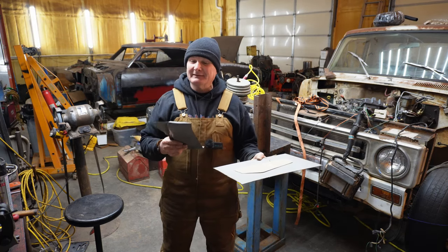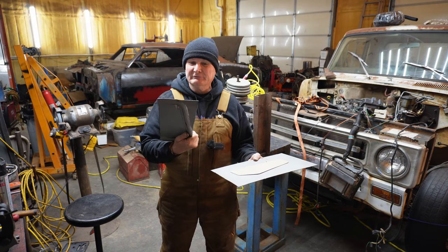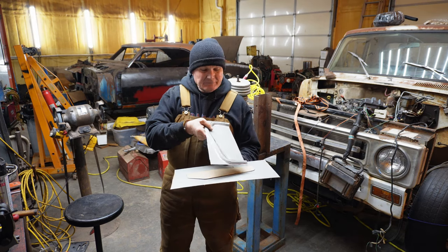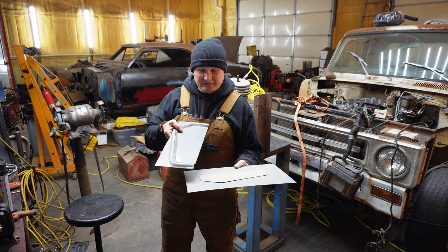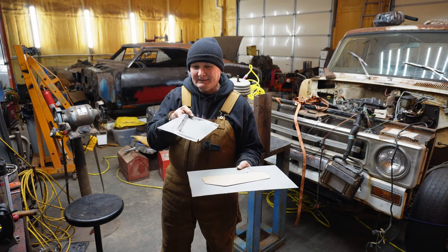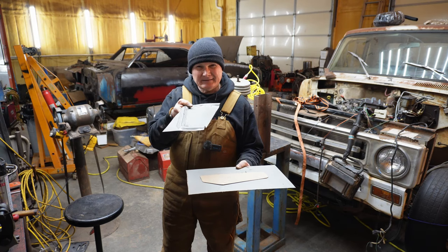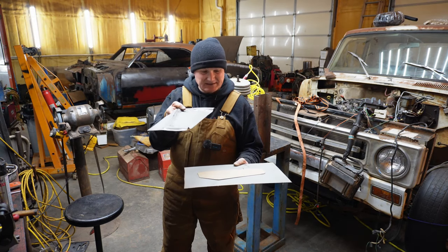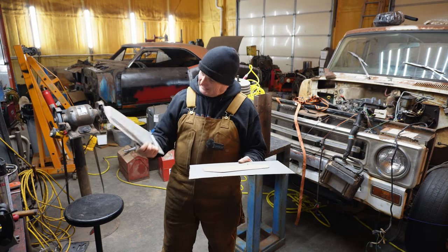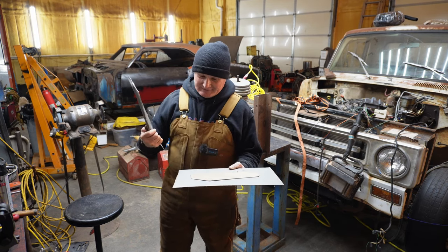The thing I did discover, I thought there would be quite a bit of wiggle room, given it didn't move very much metal at one time. But I definitely learned the first pass around, you want to be on the line. Because once it gets a little bit of a bend in it, in the forming of the bead, it's kind of tough to make it change directions. That surprised me, given it doesn't bend it very much first. So anyway, if you do something like this, stay on a line the first time.